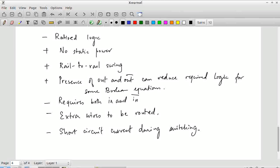Over here, on the other hand, for the very basic functionality itself, for some amount of time both have to be on. Then the other side PMOS turns on and the positive feedback starts. Okay? So the dynamic power, that is the power consumed during switching due to this short circuit current, cannot be neglected.